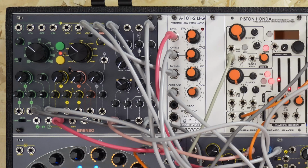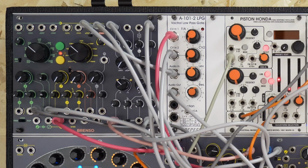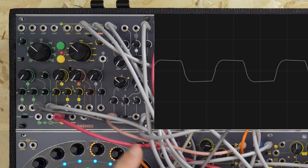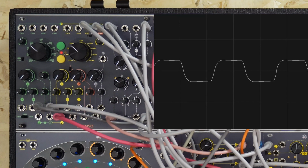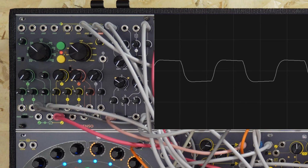And since they are semi-normalized to each other, in this case, I only externally modulate the FM deviation, meaning the amount of modulation being applied to the oscillator. I use the pulse shaper output, and what we hear from this output is made by the transformation of the original waveform. The triangle wave passed through the triangle shaper, which feeds the comparator, deriving a pulse wave that finally goes into the pulse shaper. This can be heard from the square out by setting the switch below the jack on the right.